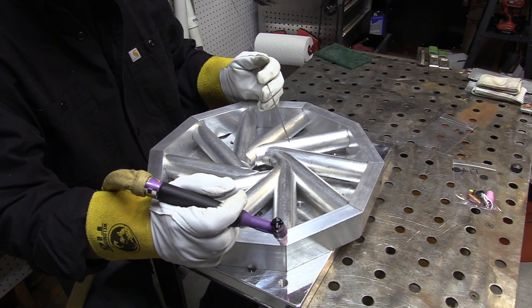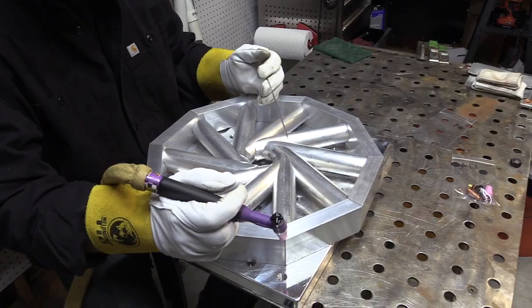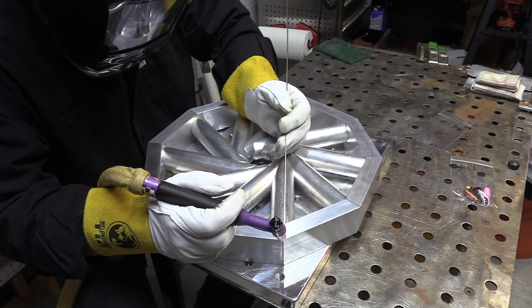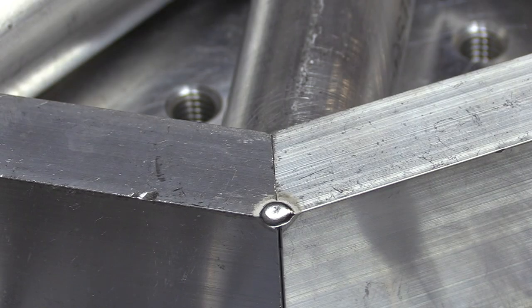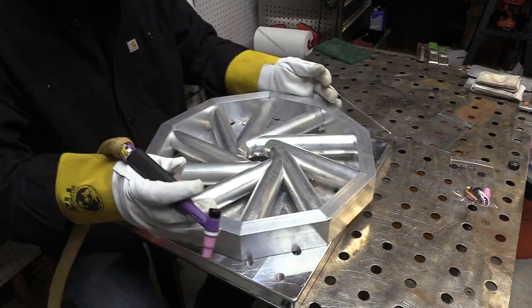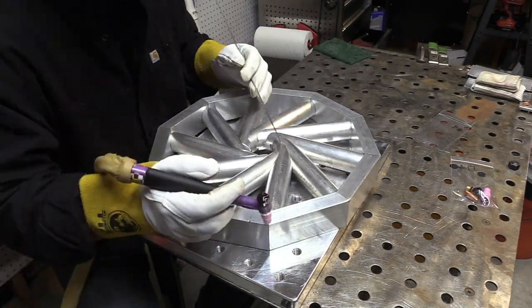One real benefit you get right away when using a No. 5 cup is gas flow — you're going to use a lot less argon. About 12 and a half CFH is a sweet spot, though all flow meters are a little different and not perfectly calibrated. A good place to dial it in is on corners: a good clean tack tells you you've got enough gas but not too much. Too little gas gives fuzzy mushrooms; too much causes a venturi effect that sucks air into the argon. You want the right amount — not too much, not too little.